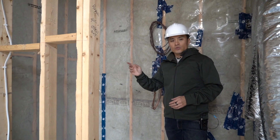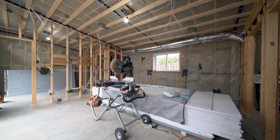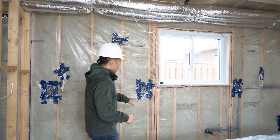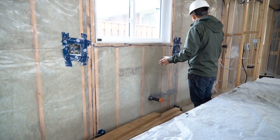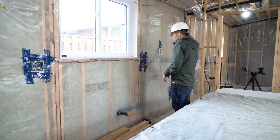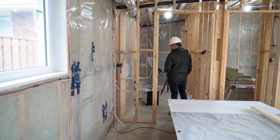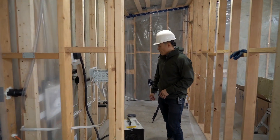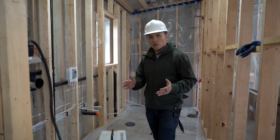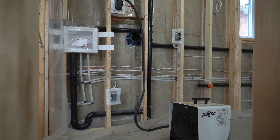Moving over to the kitchen, right here in the middle of this window is where the kitchen sink is going to be. The actual lines aren't shown here but you can see there's a connection going into the bathroom. In here you can see several half-inch lines — even though the main trunk coming in is three-quarter inch, all of the individual fixtures and faucets are supported by half-inch.